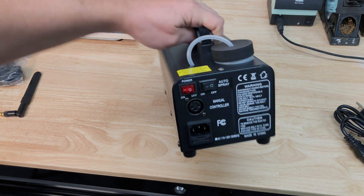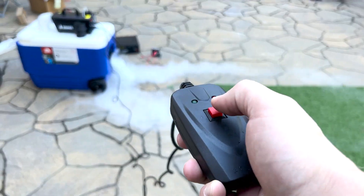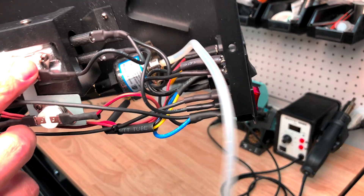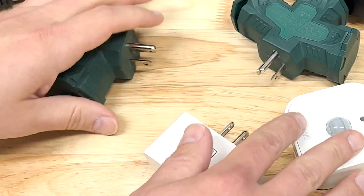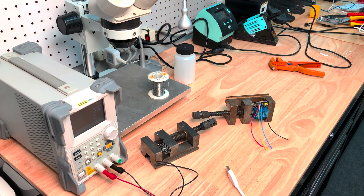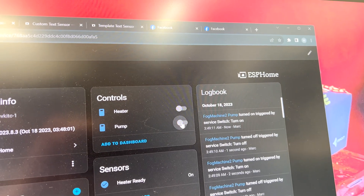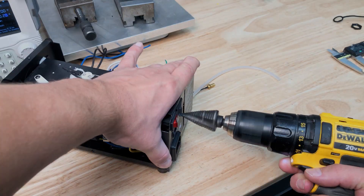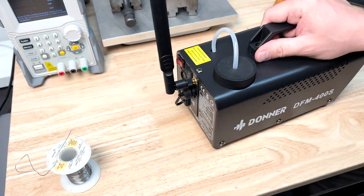Here's where things go off the rails a bit. I realized this fog machine is going to be sitting on my porch running forever, day and night, but it only needs to run for short bursts of time. Also, because the fog mixes with the water vapor, you don't actually need that much fog. All fog machines have two basic parts: a heating element and a pump to push the fog juice through the heating element when you want fog. What I really need is automation. If I just put the whole fog machine on a smart outlet, it would warm up, but I'd still need a way to push the button or run the pump. If I can connect my fog machine to open source home automation software, I'll have the ability to remotely warm up the heating element at a certain time of day, as well as trigger the pump to run exactly when I want — creating fog in small bursts, or when people walk by a motion sensor. I now present to you the Wi-Fi fog machine.